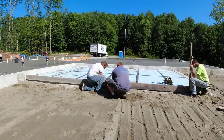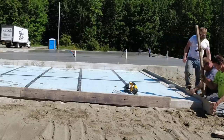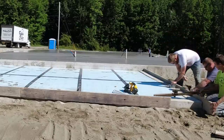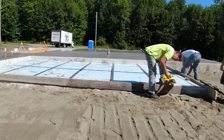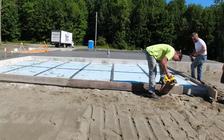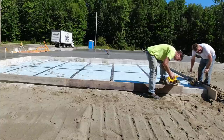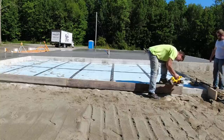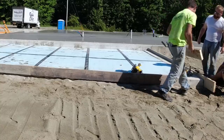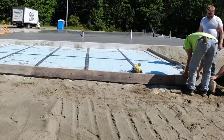If you're a returning viewer, well thanks for coming back. Now what we're doing right now — this house, garage, and patio all had a frost wall put in. Around the patio here we're forming up using Tapcon screws with two-by-eights to get the height of the patio slab. We were told the top of slab wants to be down four inches from the house. You can see a chalk line we snapped on the foundation down four inches, and then we're sloping the patio about an inch out towards where we're putting these forms.